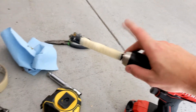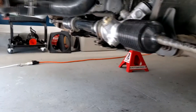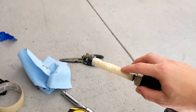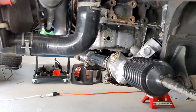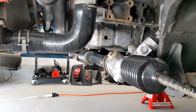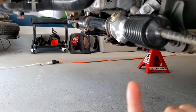This is a half-inch drill bit — I think they specified 14 millimeter — because the hole is supposed to be for a 3/8 NPT barb. 14 millimeter is pretty close to a half inch, but they're not the same. I'm going to see how the tap does, but I'm not super hopeful. Maybe I can just go super slow.